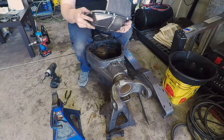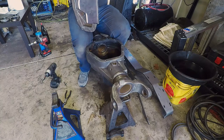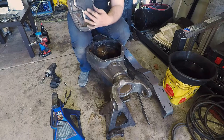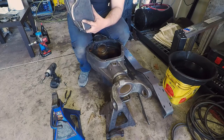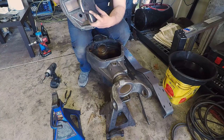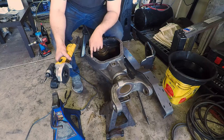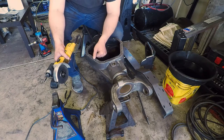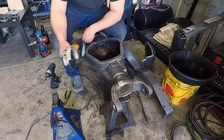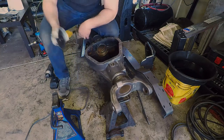It's also a good thing that we put this on here because it shows I've got this big gap where this AR500 plate - the skid plate mentioned in the ad - goes on. So I could even cut another whatever the thickness of this is out of it. Looks like 3/16ths to me, could be quarter. After a little deliberation, I've decided to not go that extra quarter inch for the AR500 plate. I'm just going to start on this line and then grind it down to the final finish. It'll take longer, but it'll be safer, and since these aren't exactly free, safer is good.